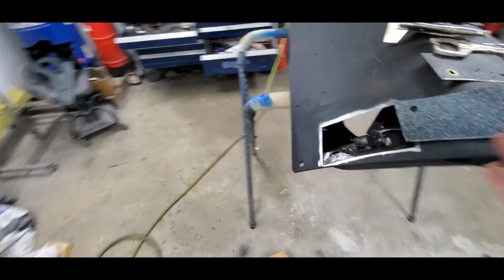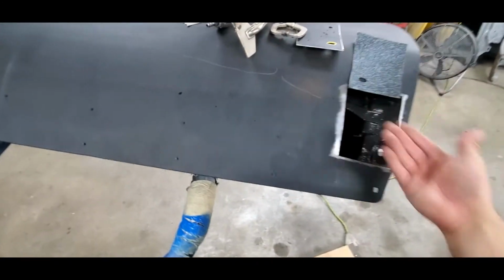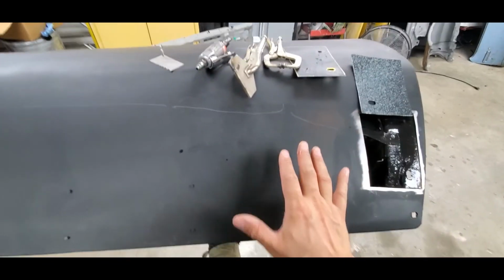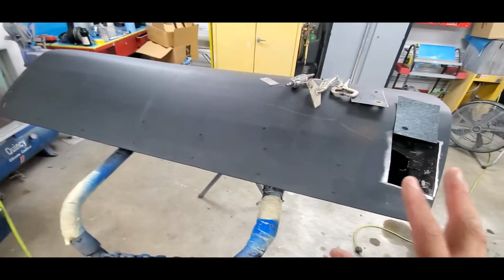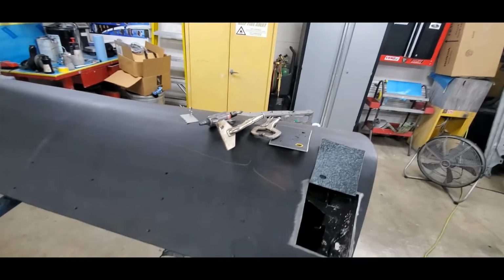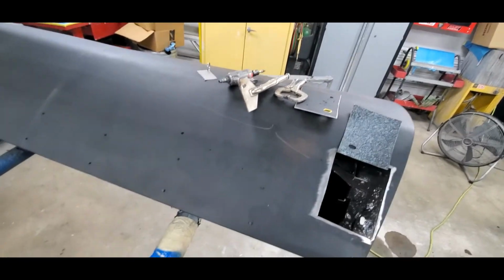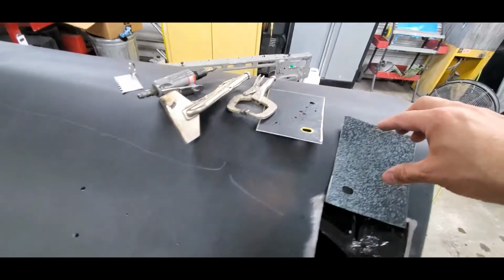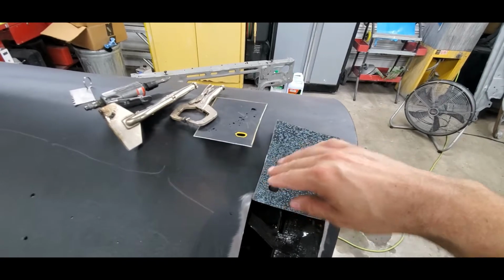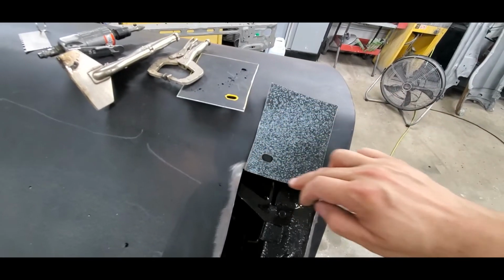And then when you're all said and done, rust proofing is an important thing. Go inside here, coat the inside of this just at the end. This car isn't going to see the rain that much. However, that wax coating will prevent any moisture from penetrating any of the open exposed spots that you have in here. So that's one thing that you'll do. I'll end up spraying a 3M weld through primer on there. Basically, we need to keep the weld zone clear.